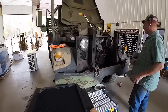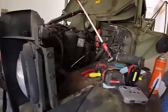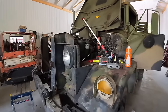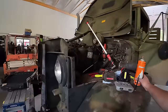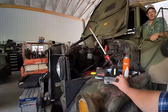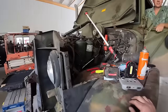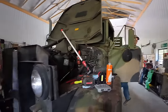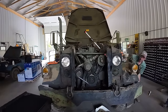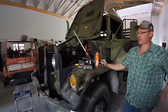Yeah, it's only been sitting here for a few months. So you got it running right, got the pump timed. Yeah, he fired up for a second. He still seems like you got to give it some juice to get the pump out first. But once it goes, it's good. Pump was out of time. Is the fuel density compensator still hooked up? No, yeah, I still got to bypass that. I got all the parts to do that. I'm going to do that later tonight. But it wouldn't start up like that before, would it? Oh, no, absolutely. You had to give it a good whiff of ether to make it even think about starting before. Yeah, it's the only motor I know of that will run out of time. It was timed to what, number 6 cylinder? Yep. The little starts are not happy.